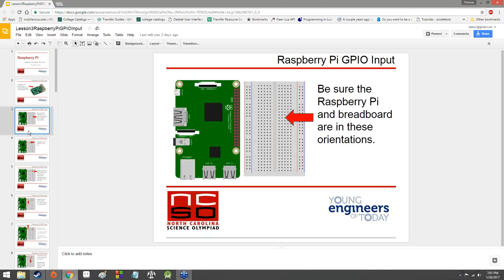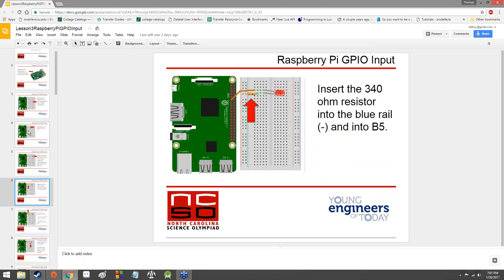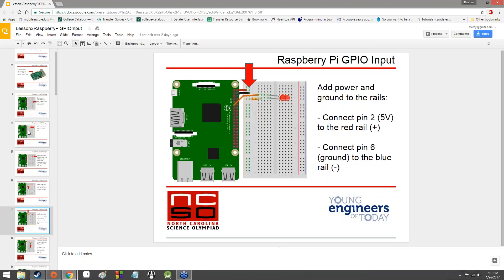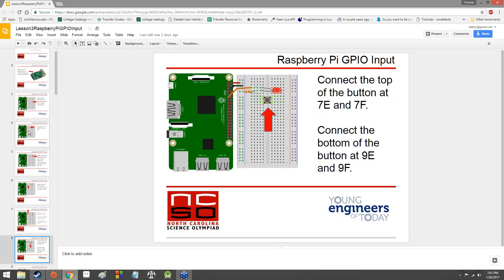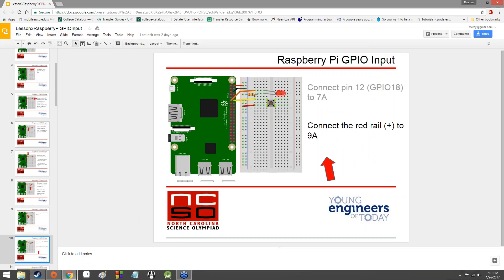As a review, our circuit is still pretty simple. It's the LED circuit we had last time, hooked up to GPIO 17. However, we did add a button into it, and the button is hooked up to GPIO 27 — that was just so we had enough space to hook everything up. There wasn't anything special or different about it; that was just a space concern. So we hooked the button up to GPIO 27, and that should act as an input.